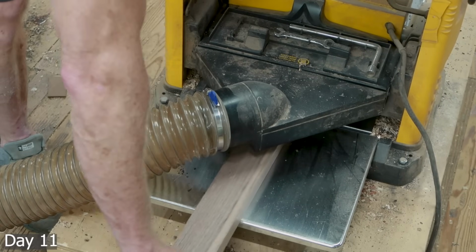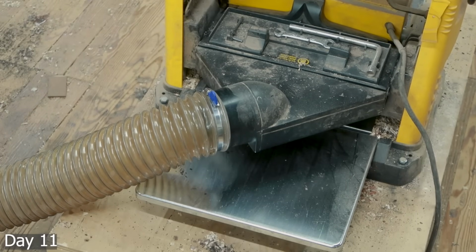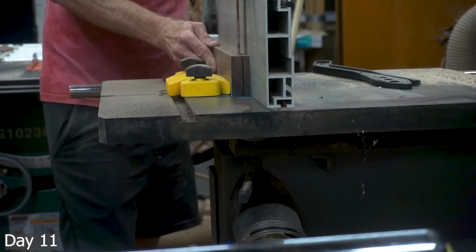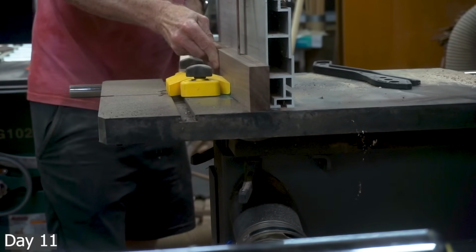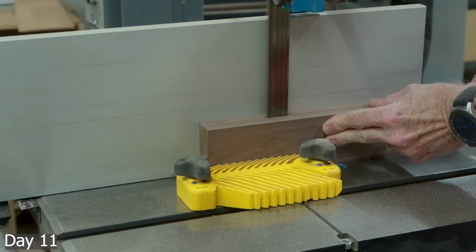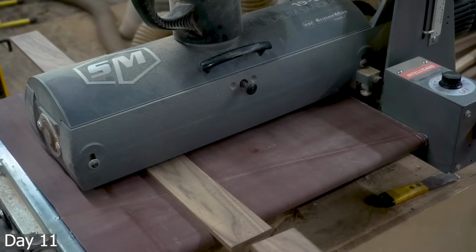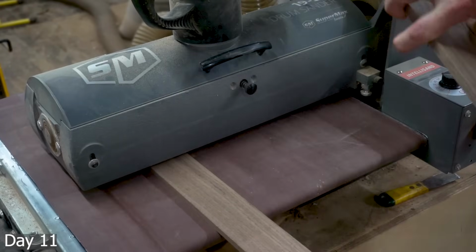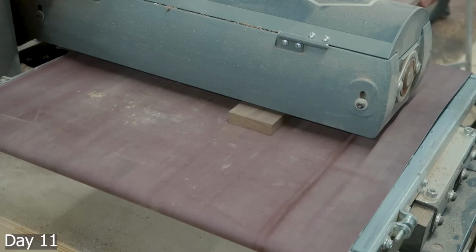This chessboard will be about 3/4 inch thick when it's all finished. I planed the frame pieces to be thicker than that because I need to slice the frame pieces so I can insert rare earth magnets into the bottom piece. Then I'll glue them back together again. The bottom piece is thinner because the rare earth magnets need to be very close to the surface.